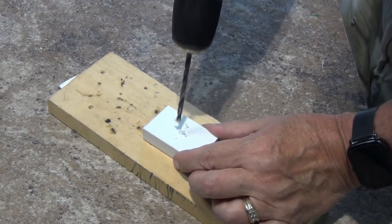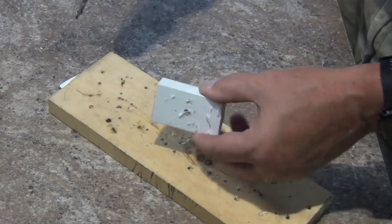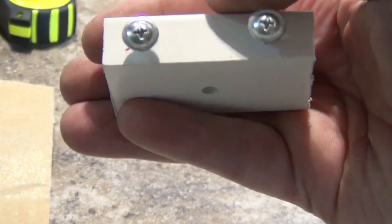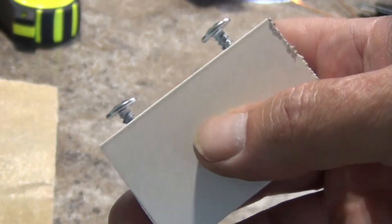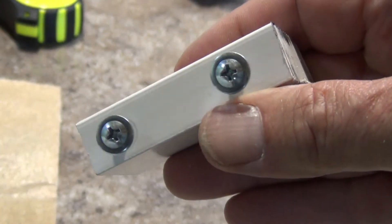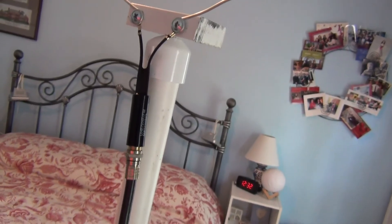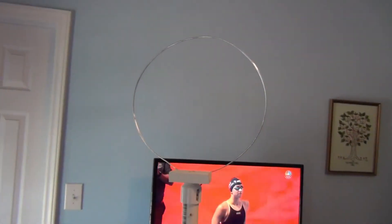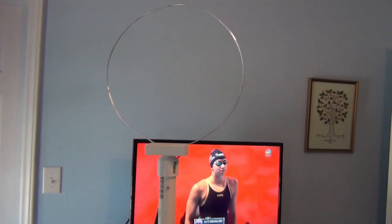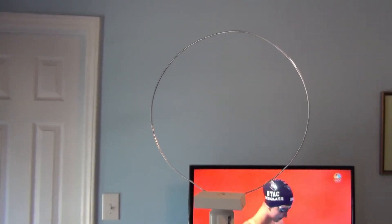To make a quick and easy antenna mount, I cut a piece of scrap PVC board. I drill a hole to run a screw through into the top of a mounting pole, then measure two spots on the side of the board one and a half inches apart, drill pilot holes, and screw in two lath screws as terminals. The finished mount is screwed into a PVC cap cemented on a piece of PVC pipe. I'm installing this in my usual TV antenna test room — a second floor bedroom. Everything is glued, clamped, and secured in place, so the only thing that will change is the antenna elements themselves.